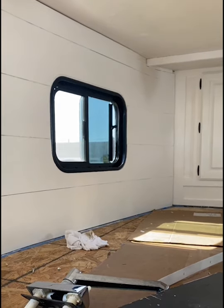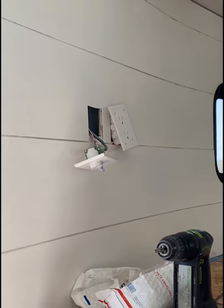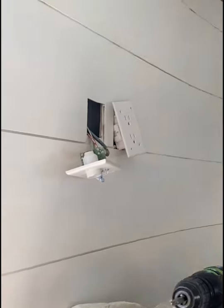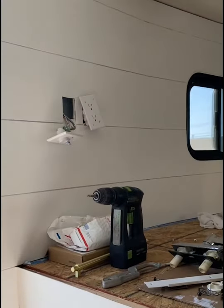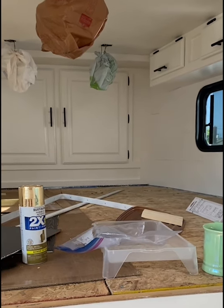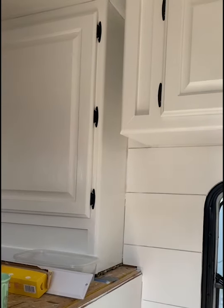I went with white because I want to do a boho trendy theme — white and black with some bold accents. I painted the cabinets the same color of white using cabinet paint. For laminate doors you have to use a special oil-based paint and a bonding primer — specifically a gripper primer, FYI. I bought cabinet hardware off Amazon for about $30, and spray painted the hinges semi-gloss black.